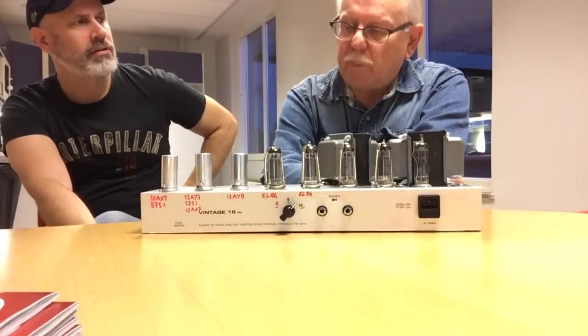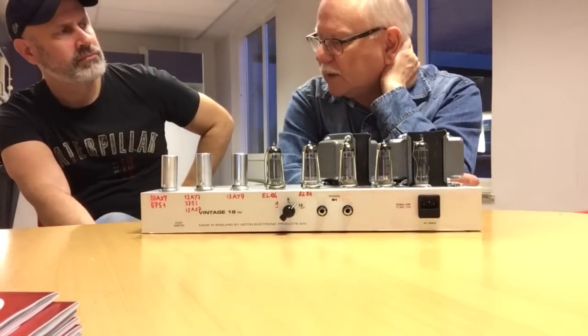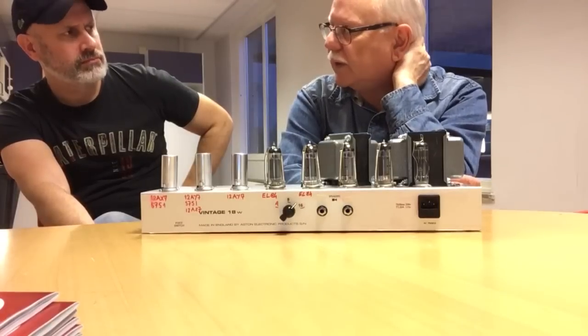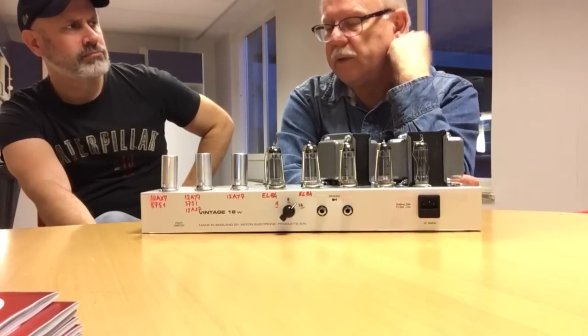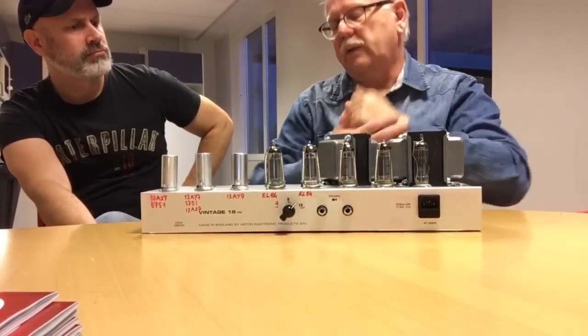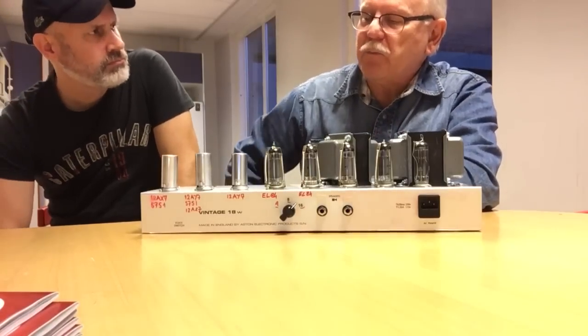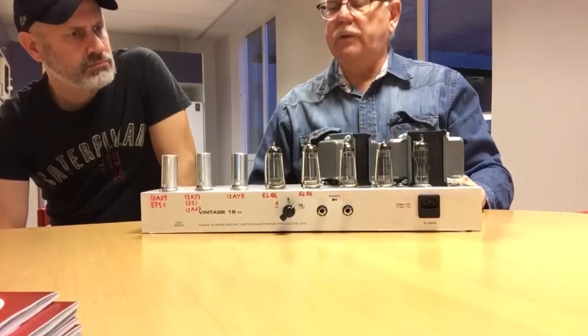And they differ from the 12AX7? The 5751 is, you might call it, a lower gain 12AX7. And why lower gain? Well, we can talk about it later. It has to do with how distortion and overdrive is generated, and it basically kills some of the preconceptions.